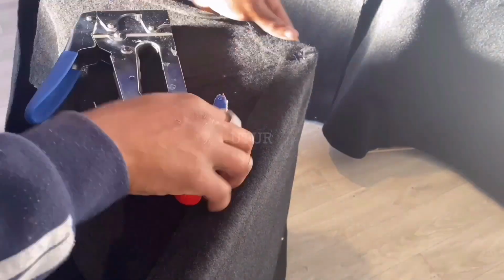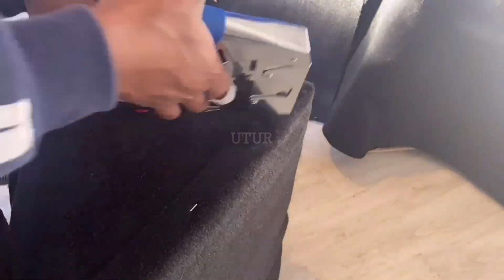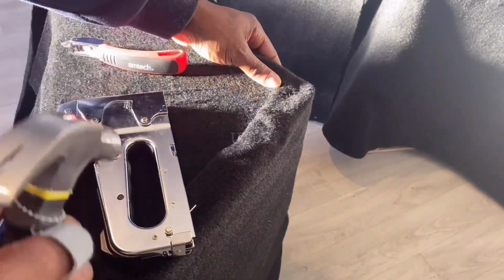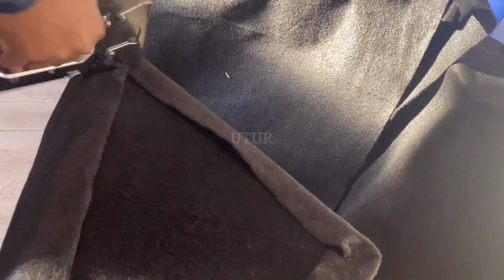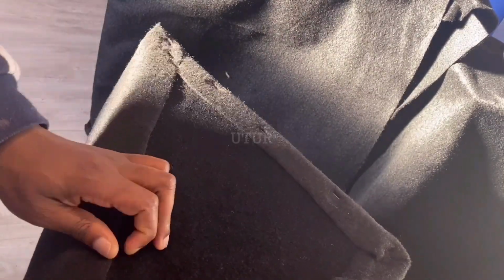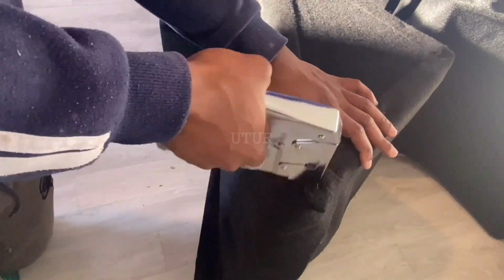If you've got any pins that do not sit flush on the base structure, get them off by all means with a staple remover, and then continue to proceed with your stapling whilst ensuring no loose ends. And once you're done stapling, ensure that all pins are flush with the aid of a hammer. Just give it a good definitive bang with reasonable force. The process in the aforementioned will be repeated for other bass traps until all of the housing frame and base structures are sealed off.